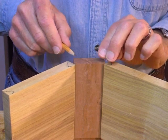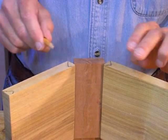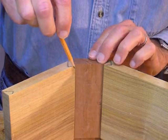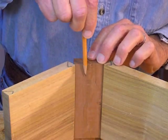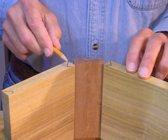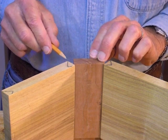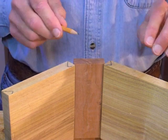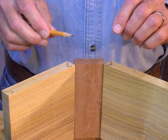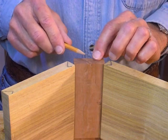In cutting the bird mouth joints, we have choices to make. The cuts can be made either in the ends and side pieces, in the corner piece, or both. Notice that the joint will be between the end grain of the side pieces and the edge grain of the corner piece. I have chosen to route the end and side pieces because a V-groove into the end grain gives two surfaces and yields a superior glue joint with the edge grain of the corner staves. Thus, the canary end and side staves will have a bird mouth cut at each end and the lychee corner piece will have no cuts at all.